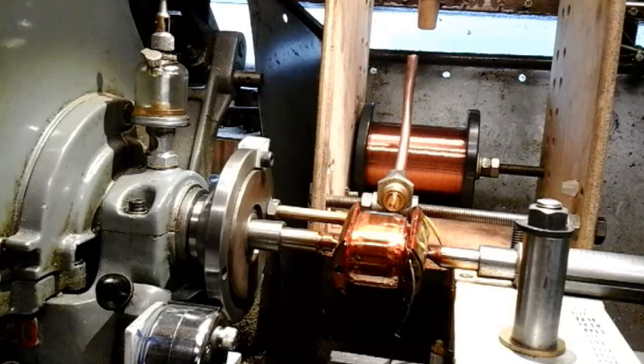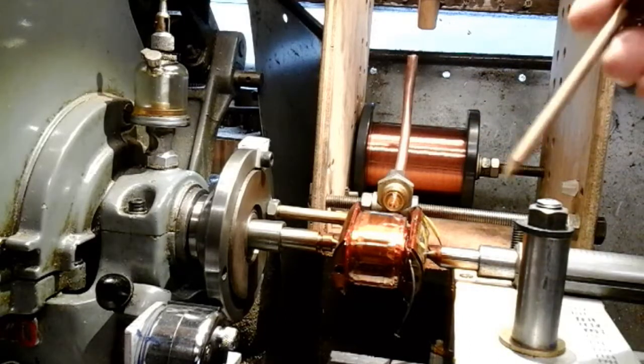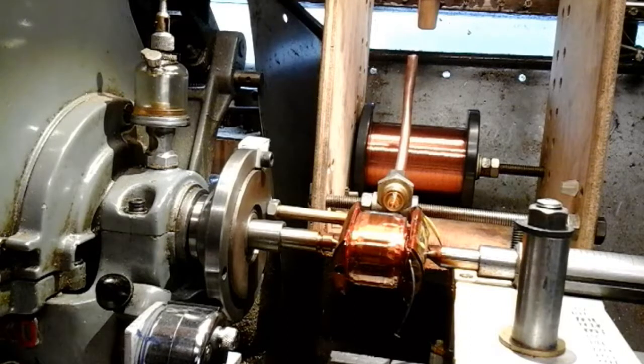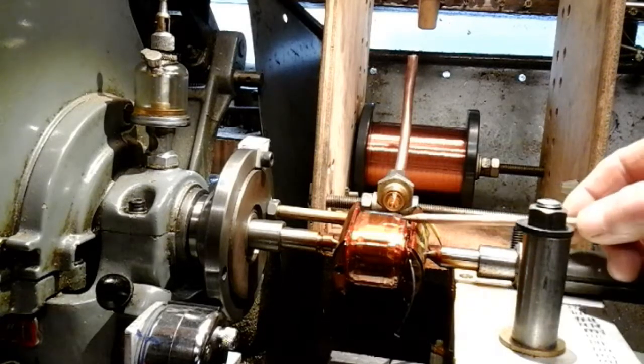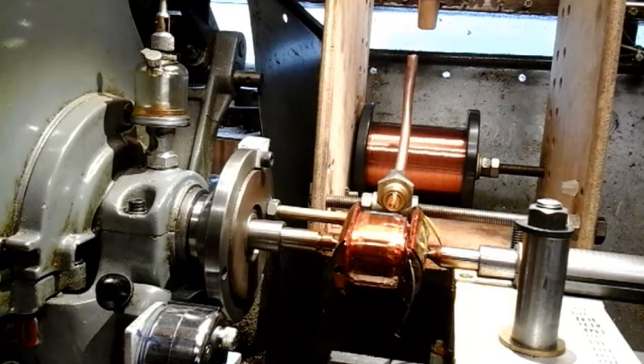So where I'm up to now - my wire's still attached, I've got my insulation tape on, I've got to cut this off and remove everything. Then I'll solder my transitional wire on to get me up to my 0.9mm wire that goes into my slip ring on the magneto. My next stage now is to apply some varnish and/or - I haven't decided yet - some epoxy resin. On Broughnut's website, he suggests that it's best done if you can have it in a vacuum, so I'm going to make a simple vacuum chamber. When I get my epoxy or my varnish, or maybe both, I can just put it in this vacuum chamber and suck all the air out so it's getting into all nooks and crannies.